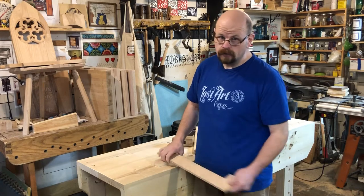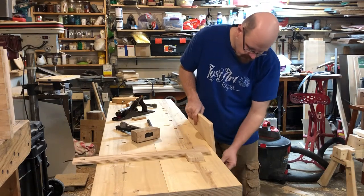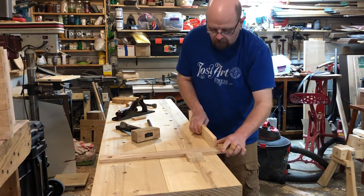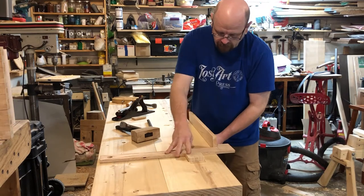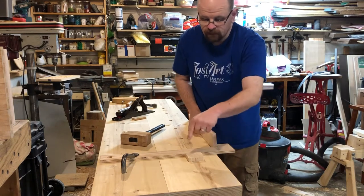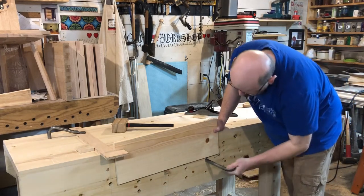So one of the things I came up with was a moveable crochet that I can attach to the top of the bench. First, I decide where I want the height of my board to be — we have all these holes drilled in the front. I help set myself up by putting a little three-quarter inch dowel in one of the holes. I can see how this is adjustable to a variety of widths of board. I catch the board in there and then catch it with a holdfast. The crochet, between being held against the plane stop and the holdfast holding it, is the trick.